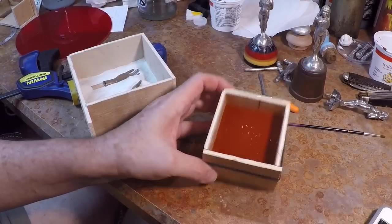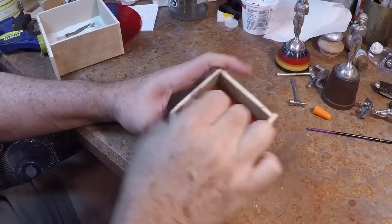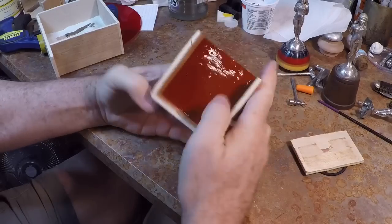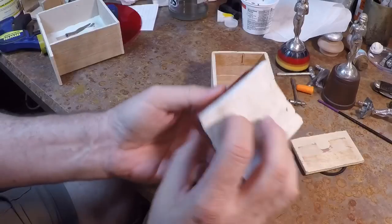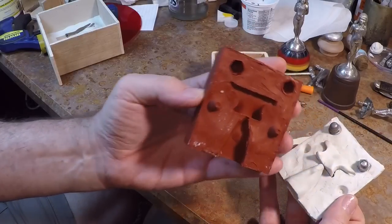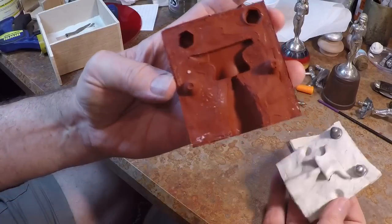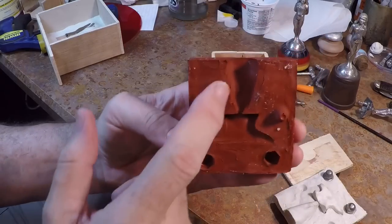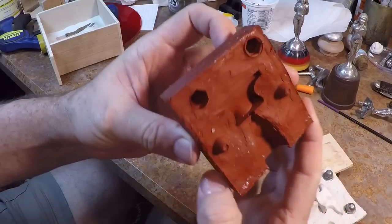Happy Wednesday — back in the shop. It's solidified, nice and hard. The tailgate pops right off, and with a little wiggling the mold pops right out. I'll remove the clay, and there's my bottom half of the anvil. I cast it with the sprue in place, which I kind of like. I'll complete the rest of the sprue when I cast the top half.